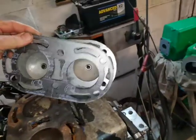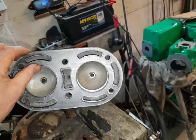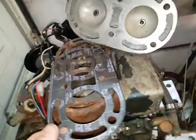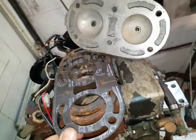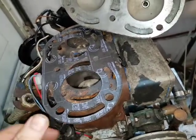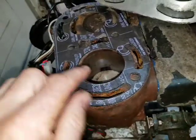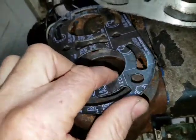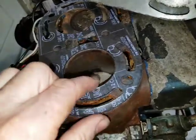He only decided not to even try it because he was fed up of it boiling up. It's a design fault. Now, I can say that because I've got an engineering degree in maritime technology, and I'm an expert marine engine builder with petrol two-strokes, and that is a design fault because it hasn't got the capability to seal the high pressure. We're talking ridiculous PSI. When that goes pop, talking about over 1,000 PSI at the edges. So it's just going to gradually creep through this semi-porous carbon gasket until it reaches the waterways. It's just a matter of time.